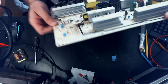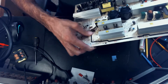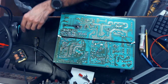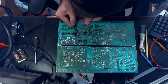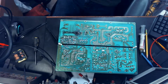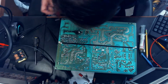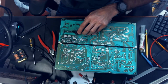The board itself, well, we'll just have to get in there and probably, I'm thinking, Dremel a little bit of this out with a little Dremel cutoff wheel, and we'll also try to go ahead and pull this trace up. We'll try to get this trace up and out of here, because we don't want that trace just kind of flapping around. We really want to make sure that we're well bonded to the board when we do that. And we're going to try to just leave that little bit of a pad there. Safety glasses.